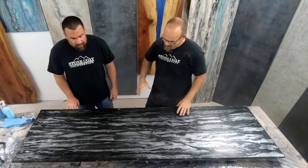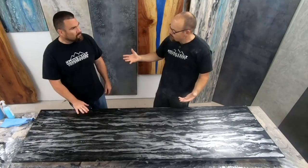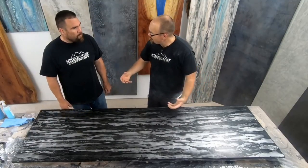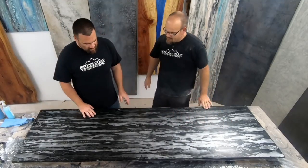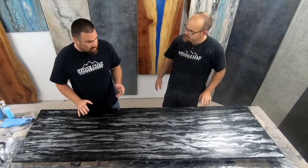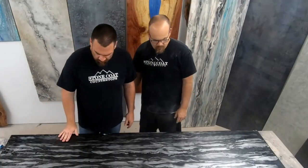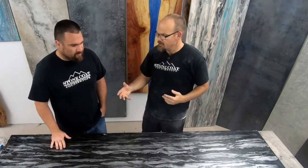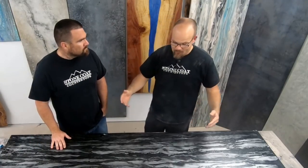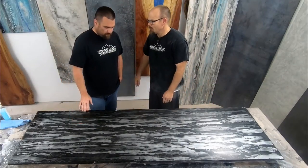We spent a little bit of time taking this and sanding it all the way down to 220, as if we'd run into some deep, heavy scratches. What do you think of the finish, Mitch? It looks awesome — the shine's a little bit lower, which I actually like better; it's a little more natural. You get a lot of phone calls every day from people looking for a lower sheen, something that's not so plastic-y, and this is what gets you there. It's also insurance: down the road, if you scratch your counters up, you could bring it back to this sheen easily, no problem.